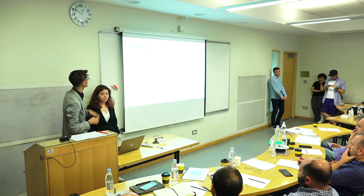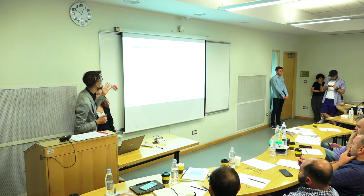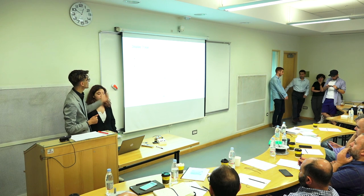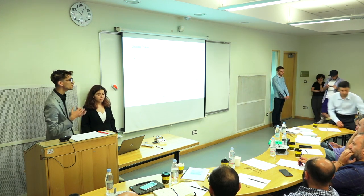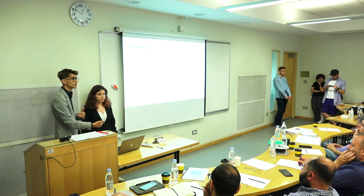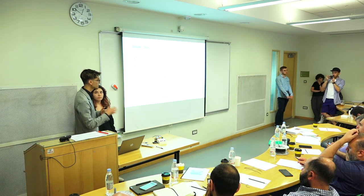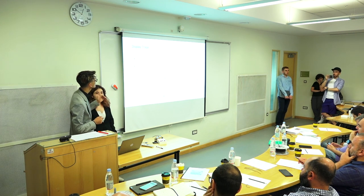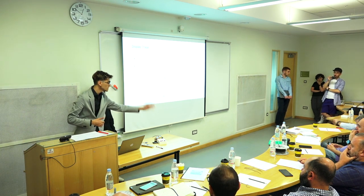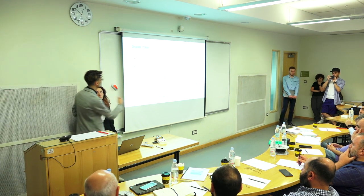After the initialization stage comes the display stage, which is divided into two sections. The first is converting electric to physical data. This is the logic that I explained earlier, but in code form. But before it gets to that, it first checks the position where the user is in the book, because we don't want to lose where we are whenever we go to the next page. It has to remember. So it looks through the data and checks where the position is in the text file, and based on that, it takes the number of characters that we have on the tablet. In this case, it only takes one character, the translated character, and then goes through the iteration.